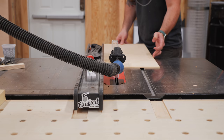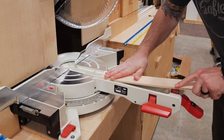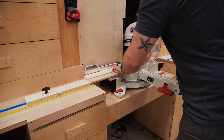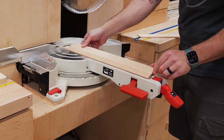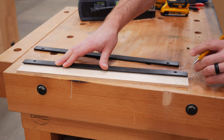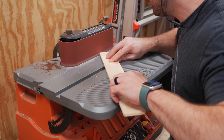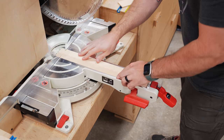The quarter-inch PureBond plywood I had on hand was just a bit too thin, but the quarter-inch Baltic birch was just a hair thicker than needed and could easily be taken down to final thickness at the drum sander. I cut the insert to rough width at the table saw, sneaking up on the fit, then cut it to length with the miter saw using a backer board to bridge the opening. Next I traced the corners of the original inserts onto the new insert and sanded away those areas using my oscillating belt sander, which made quick work of it, and the insert fit great.